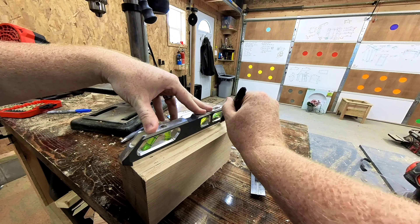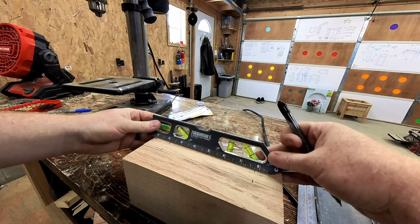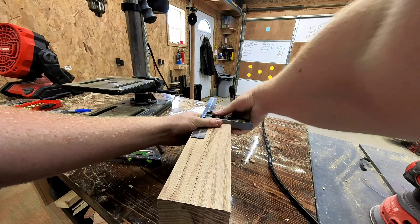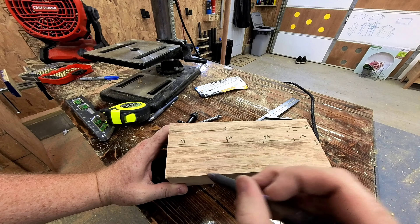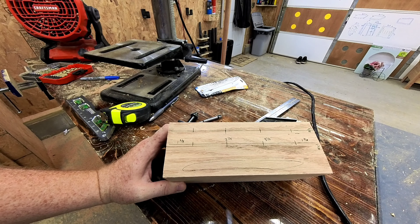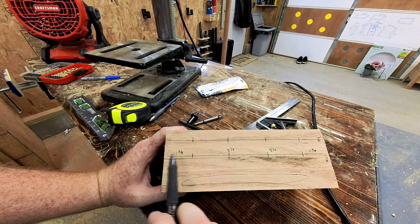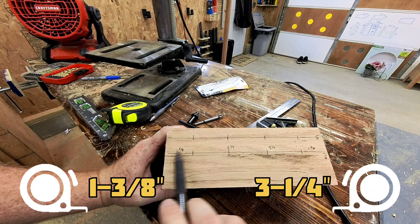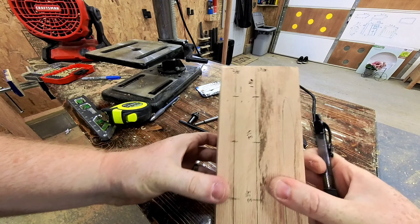I marked a few reference guides on the top of the bigger block, going for a minimal approach. The more holes you want to drill, the more likely it is that one of those holes will not be centered with the rest. For the big block, I'm going to cut in a groove down here for a pin holder so that it lays horizontally, and then have four spots for pins, markers, whatever. I came in one and three-eighths for my first holes and then three and one-quarter in the other direction to get them evenly spaced.